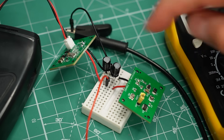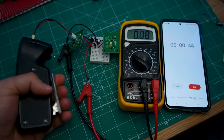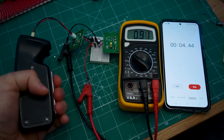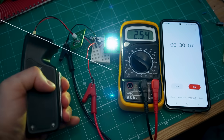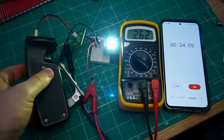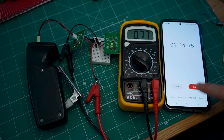For the following test, I added a second supercapacitor in parallel and the whole circuit is now being powered from the flashlight. It takes about 5 seconds of charging for the LED to light up. Some of the generated energy is powering the LED and the rest is stored in the capacitors. The voltage keeps rising and after about 30 seconds the capacitors are fully charged. They keep the LED on for about 40 more seconds — better than nothing, but not impressive either.